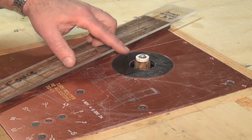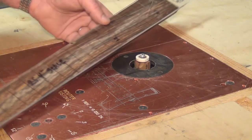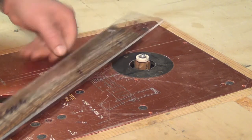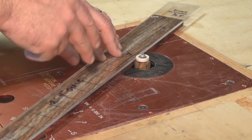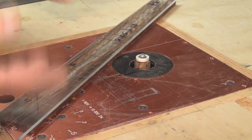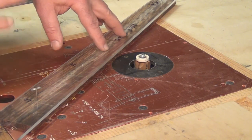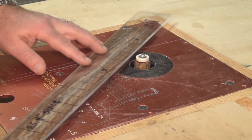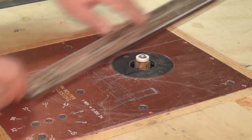I've set up one of my binding bearings — this one's going to make a 3/32-inch rabbet cut, and I'm going to run the bearing on the template that's been secured to my fretboard. I've got the locating pins and also double sticky tape — I don't want this moving at all or I'll have to go back to step one. Normally I'd run in one direction if everything was nice straight grain, but this cocobolo has a little inconsistency in the grain — a little swale — and if I ran straight through in one shot I'd risk chipping out. So I'm going to do a climb cut first and then finish off by going straight.